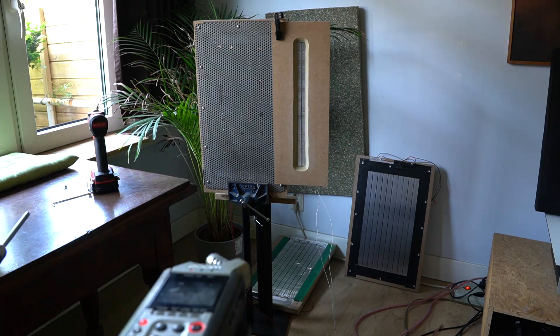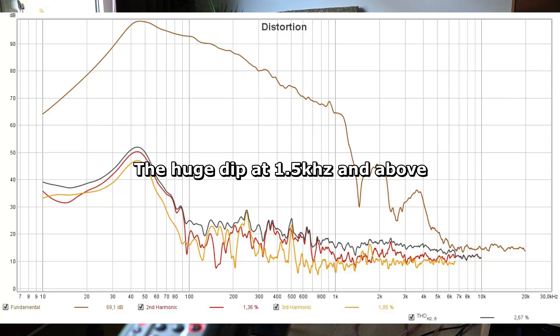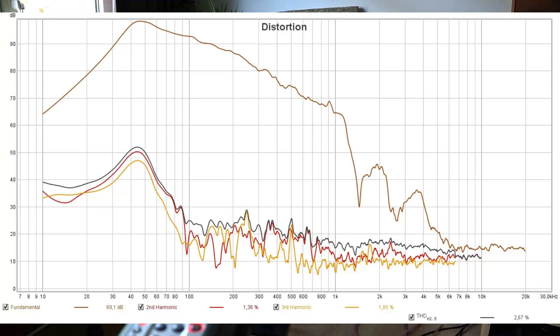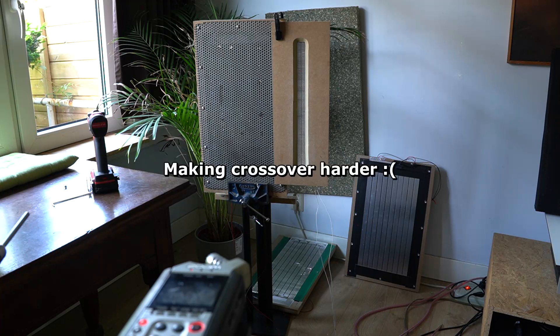Something to note is that the upper range does not look as smooth. It might be the metal plates on both sides doing that. It might also be that the amount of coil I used on the bigger panel is much wider. That could be a reason — and maybe the mylar. So first I'll change out the mylar, see if that still has this problem. Then I might make the coil wider, see if that makes the problem go away. If not, then it's the metal and just the whole construction being in the way. It's only used for low end, preferred to be crossed before 300, maybe 200-something.